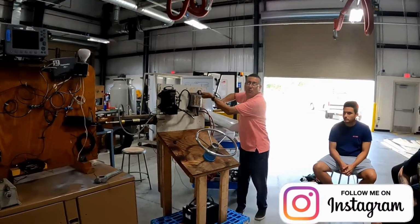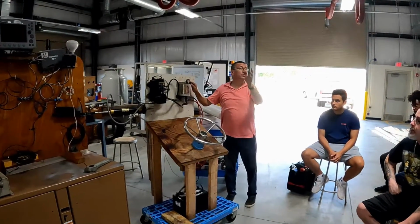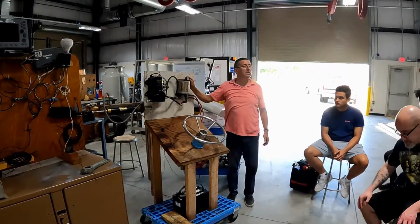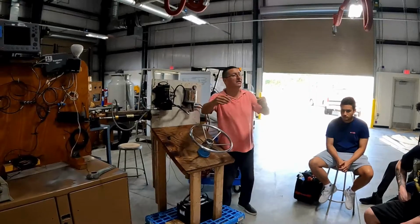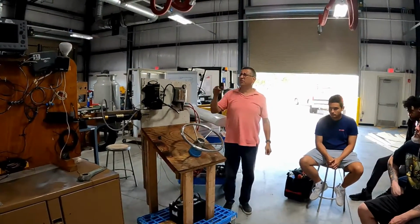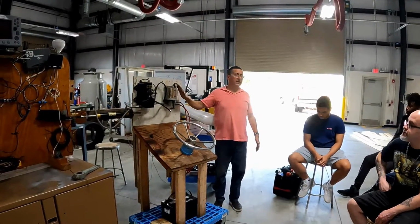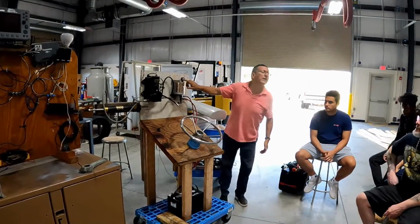And do not use your air compressor. No. Because with the compressor you introduce 60, 80, and you explode, all right? With the bicycle pump. For that reason, in the majority of the boats in the transom, they have the hand pump over there. What is the pressure recommended? 30, 35? It's like 25 to 30 psi. 25 to 30, all right? Depending on the manufacturer, but normally, you see, I have 25, 30, it's okay.